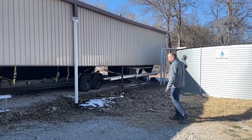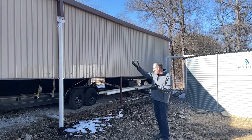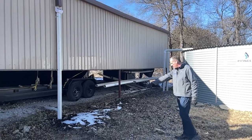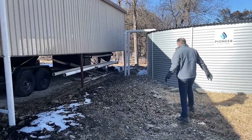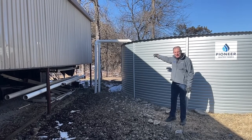This 30,000 gallon tank behind me is a Model XL23 from Pioneer. It's collecting rainwater on this downspout and also on other downspouts in different parts of the building that you can't see. That water then goes into piping that's underground, called conveyance piping, and it makes its way up the top of the pipe here and 90s over and into the top of the filter basket.